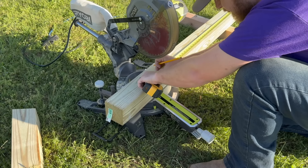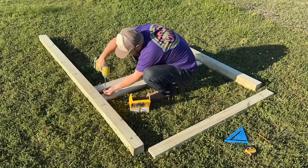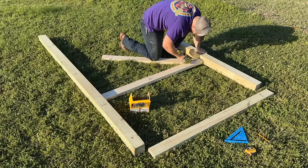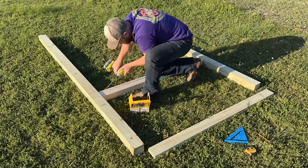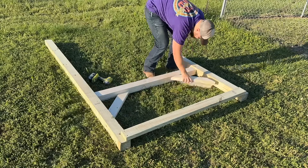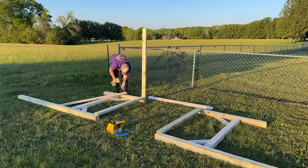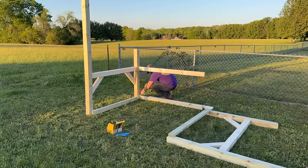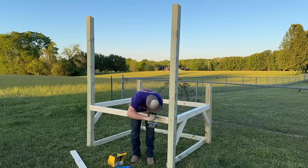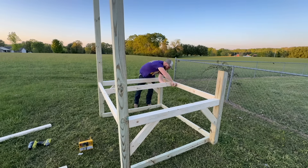The first thing we're going to do is build the main frame of the chicken coop. We're going to use two 4x4s cut at a 15-degree angle at the top, and then two 2x4s for one wall of the main structure. I'm going to fasten those together — one of those is doubled up, two 2x4s — that way it will be really supportive of the floor structure, and then the one on the ground will just stabilize things. Every board touching the ground, including the 4x4 posts, is pressure treated. The front area will be accessible by the chickens from underneath inside the run.